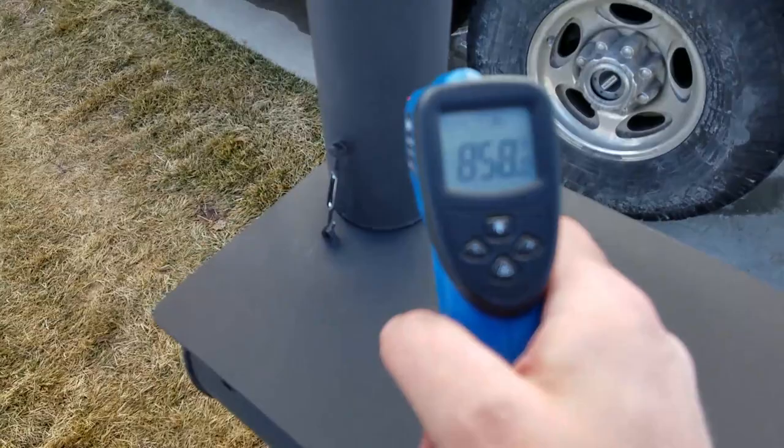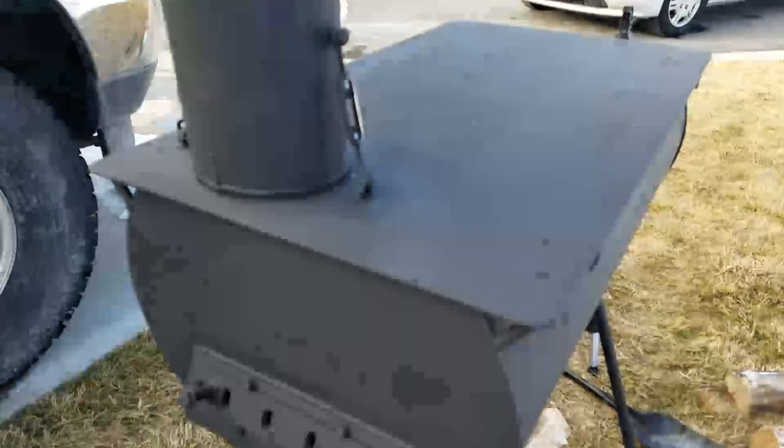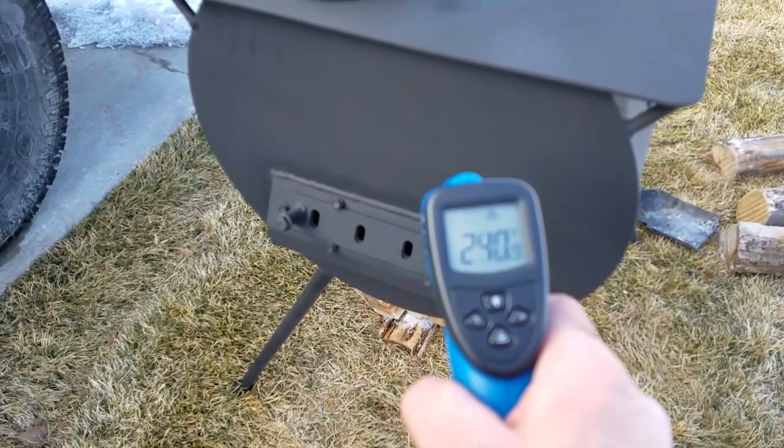The flue — that's about 800 degrees. Flue 600. You can see the smoke coming off. Do you smell it? That's why we need to do this now. This intake back here is 110 degrees — I can touch that, I don't want to — but the wall itself is a couple hundred.